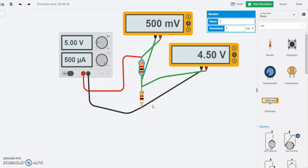So that is the concept of voltage division. A voltage divider is essentially a two-resistor network: two resistors in series, a voltage supply on one end, and ground on the other. We measure the voltage either across the top or the bottom. The voltage divides according to a formula: whichever resistor you're measuring across, divide that resistance by the total series resistance, then multiply by the input voltage. That's the concept of the voltage divider, and that's what we'll use to work with a photoresistor.